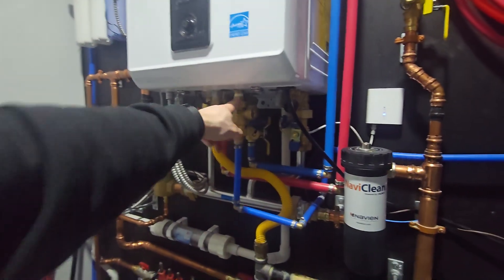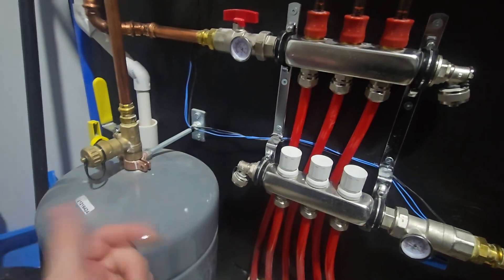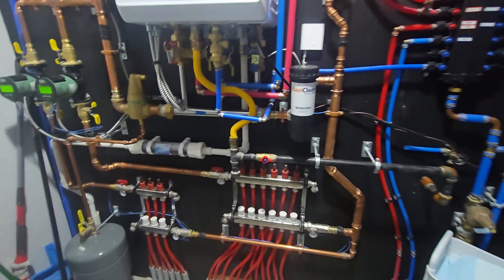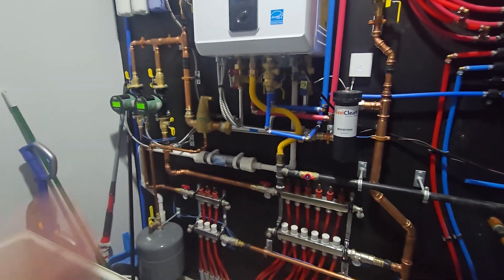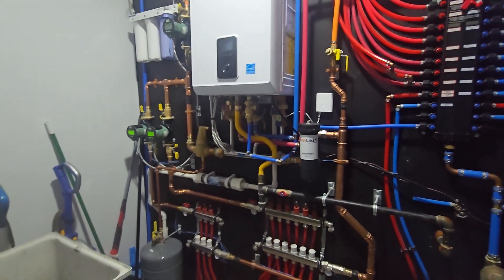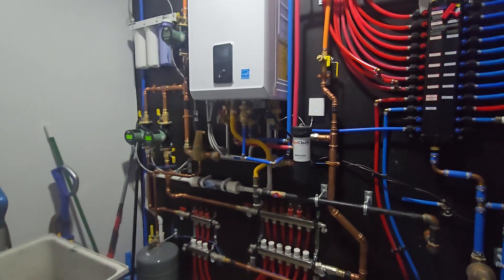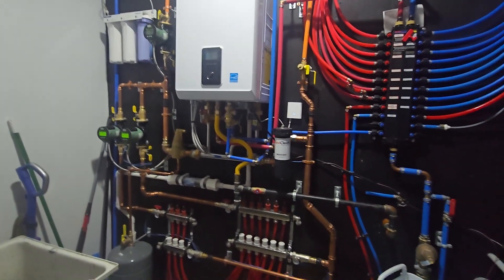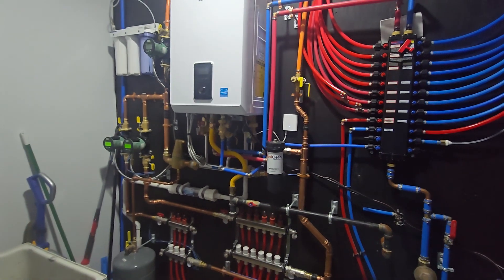Even if you don't have an auto feed, a lot of times off of an expansion tank you would have a fill valve or a pressure regulator. There are reasons you would put it on the expansion tank and where that expansion tank and fill valve or pressure regulator would be placed in the system — we could talk about that separately. But regardless of how you're filling, 12 psi is pretty much the go-to. Every system may be slightly different, especially when you're getting into larger systems or systems that have to push water higher up, which can require raising the pressure.